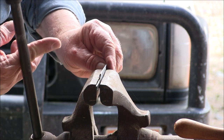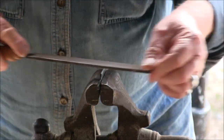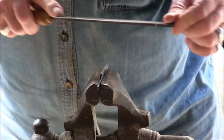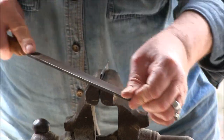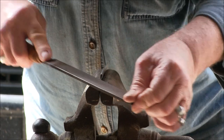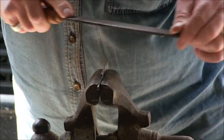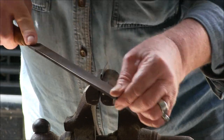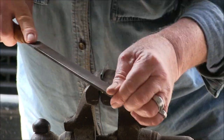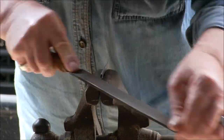There are a couple of ways you can fit an antler handle. With the larger pieces you can very often just push it straight in. If you have trouble pushing it into the antler, you can boil the antler first, and while it's still hot push the tang into it — or more correctly, push the antler handle onto the tang. You won't be able to just do it with your fingers; push it in for a nice tight fit.